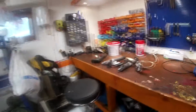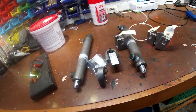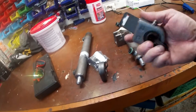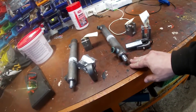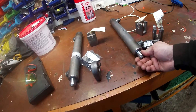If you've seen my video with the homemade rotor for the Terex, you also know that I have a plan of building a rotor tilt by cutting off the tilting part on top of my grading bucket with hydraulic tilt and welding that on top of the rotor, then attaching hydraulic rams. I ordered this last year - the plan was building it this winter but I didn't get the time. The hydraulic rams on the tilt bucket today are too short, so I needed something longer - these ones will give me around 40 degrees of tilt each way.